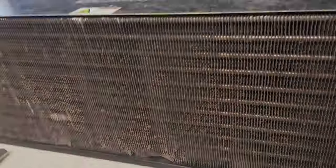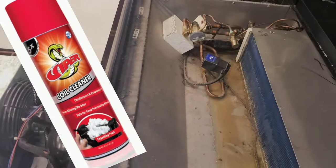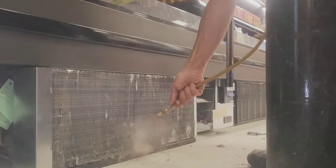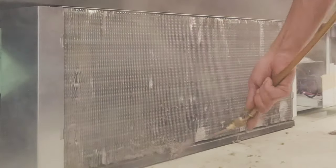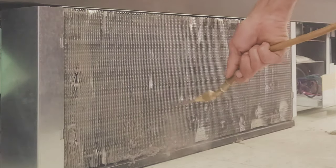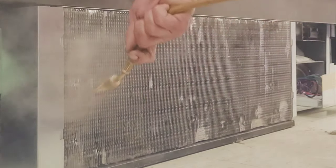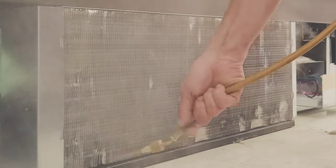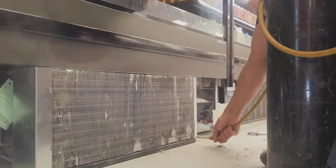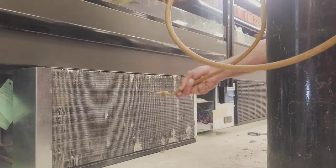Going above and beyond the compressor replacement, the coils were dirty — both evaporator and condenser, all four of them. I went ahead and included it in the job to clean both of them. I used that aerosol stuff — the Viper or the Black Frost, I think. Usually what I do with dusty dirty condensers is just use compressed nitrogen when they're on the floor like that and you can't get anything underneath them to catch the dirty water, unless you've got a shop vac. I usually don't have a shop vac since I don't have much room for extra things I don't use that often.